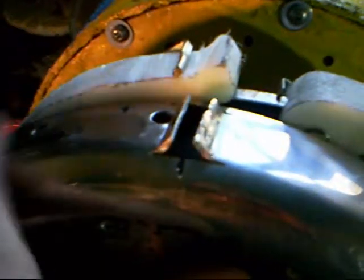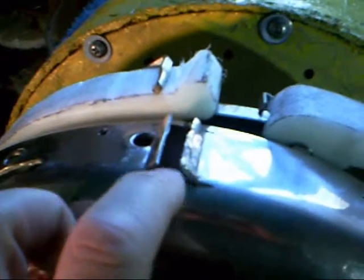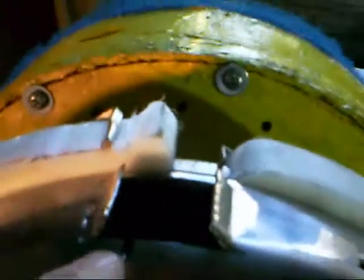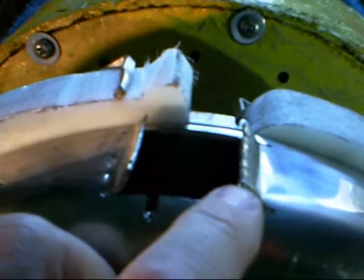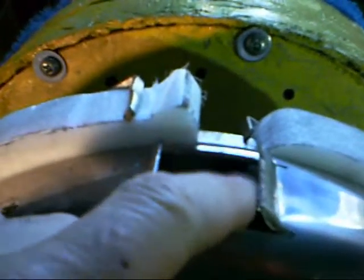When the fingers are held in as they go around the drum and the tips start to come out, they won't come out very far over such a short distance. All the slots should be expanded so the fingers can travel in a straight line far enough to come out quite a ways.